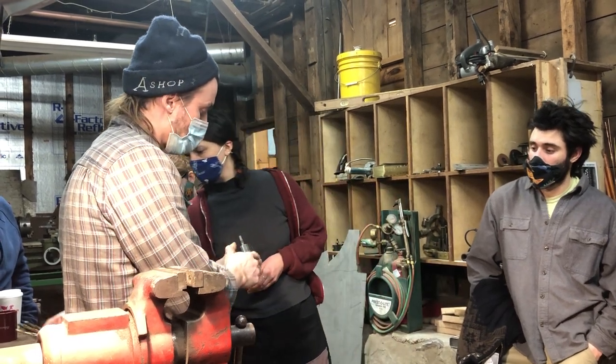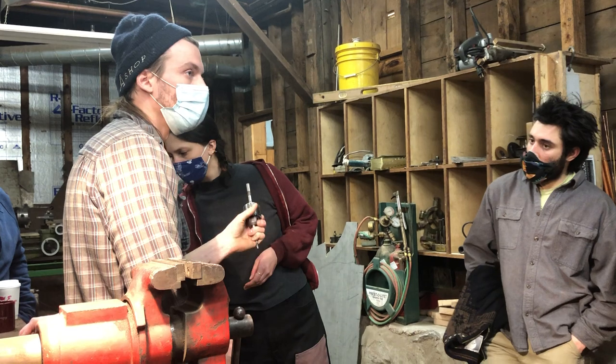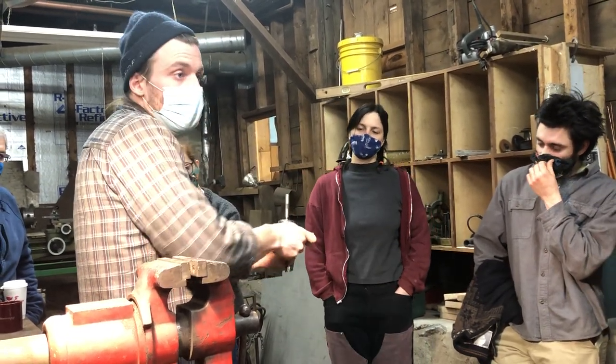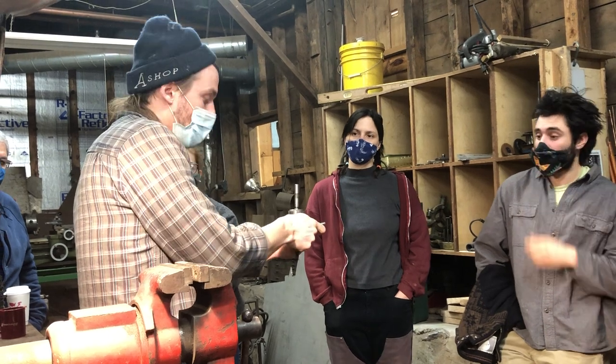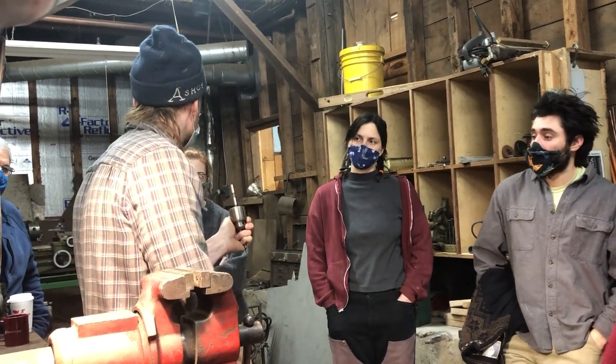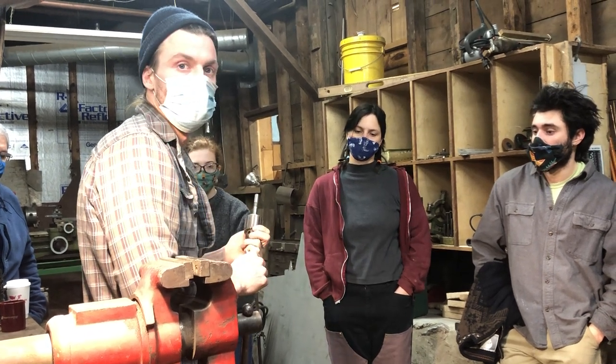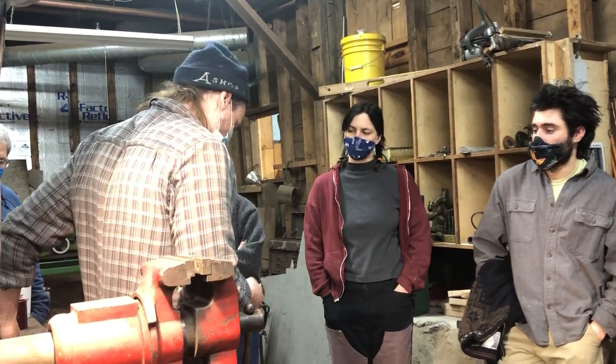And I always keep my fingers on the drill bit closed and on the chuck key. Because in a drill press, I don't want this chuck to be spinning. And I also don't want the drill bit to fall out the bottom and smack the steel because I've spent time sharpening it, you know?